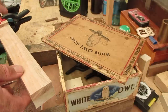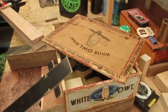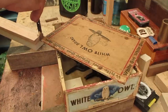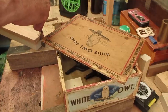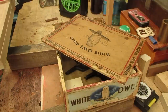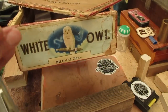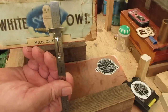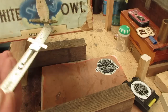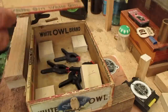What I've got to do now is figure out the pocket depth - that's the thickness of the pocket. Let me make sure you can see here - I'm just going to take this, set it there like so, and slide it down. That right there is how deep my pocket will need to be. I've got it marked out already on the box - I'm going to leave that piece up there, come down, and it will be right there. I'll tape that off before I get to working on the outside of the box too much.